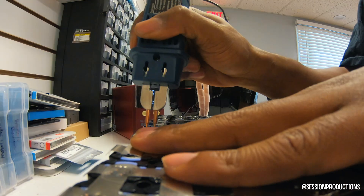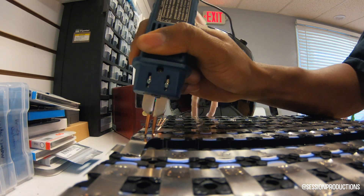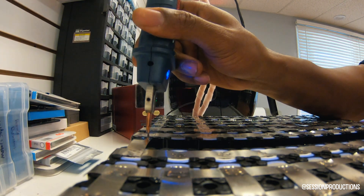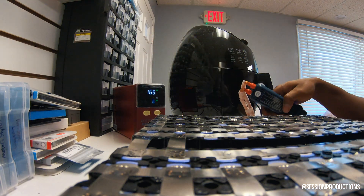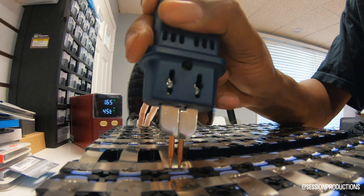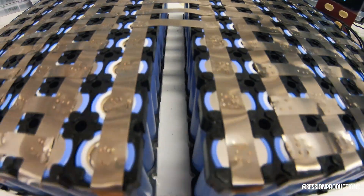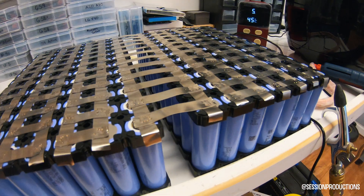You're gonna place it down and try to be as neat as possible, because you don't want it to touch the other side — they will spark even if a tiny piece touches. Right now I'm just lining everything up so it'll be a little easier. I have a little piece I can line it up on, and then you just hit the spot welder and make your tacks. You really just want to get one side down and then the other side is easy. I found this method the most effective because there's not that much heat transfer, since there are so many paths the current flows through to the next series of cells.